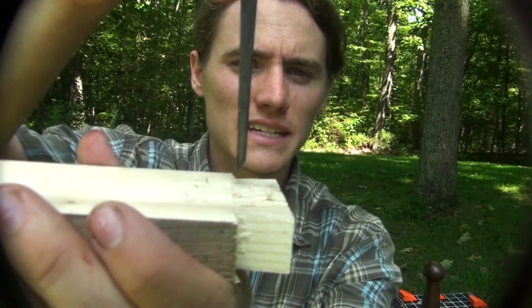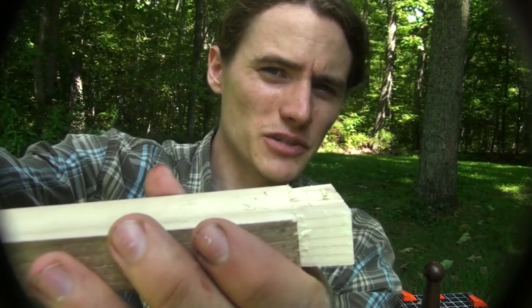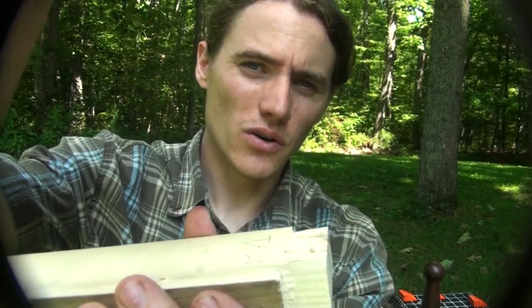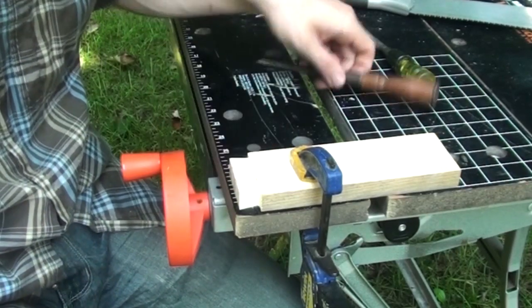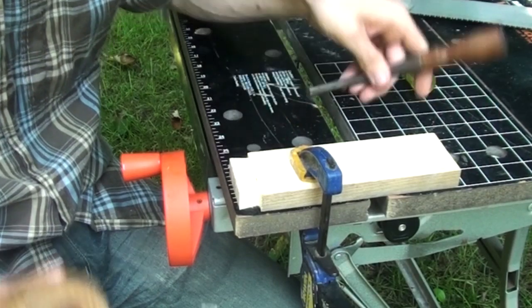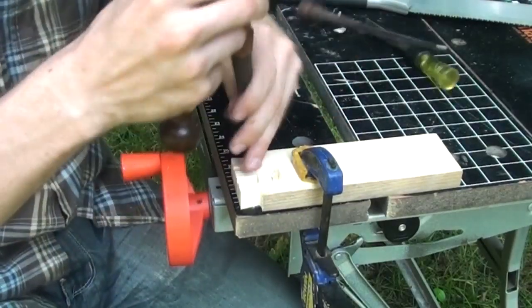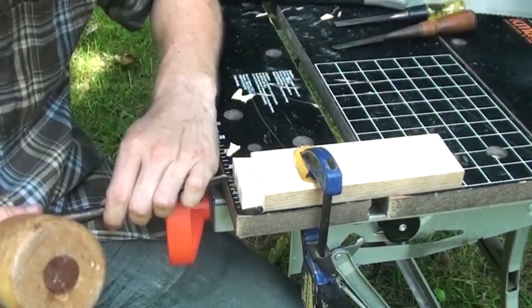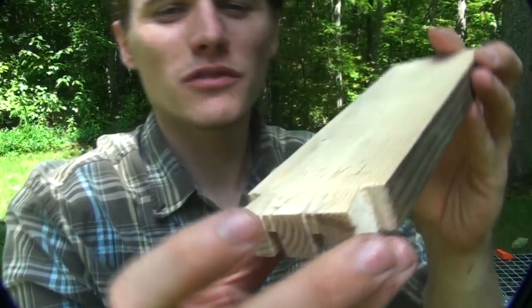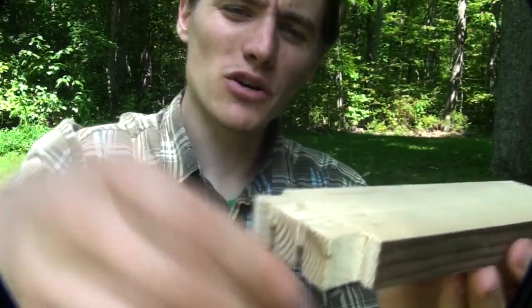Make sure you're holding your chisel the right way. If your board is oriented like this and you're chiseling, you want the bevel facing out. If you chisel with the bevel the other way, it will dent the wood past your baseline — no matter what, don't go past your baseline when sawing or chiseling. I chop down with the chisel that's a little narrower than the gap, then come back with an even skinnier chisel to chip it out. To avoid tearing out the back side, once you're about halfway through, flip your piece over and finish it off from the back side.